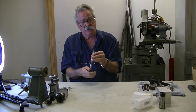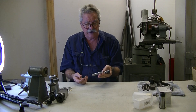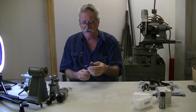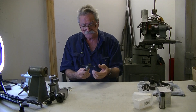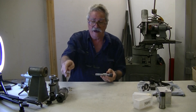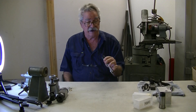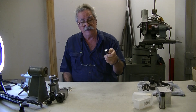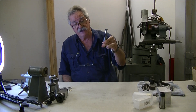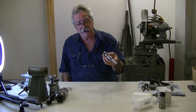This is a little beauty — once again, eBay. I think about $70 for the full set of collets up to 12mm. I'll be using that later today to four-facet grind a little drill. Plain shank, 16mm, so I can use it either in an ER-style chuck or in one of these plain bushes in the Clarkson work head. That really does give me a lot of usefulness, and it goes up inside the milling chuck if you want to do any small milling inside pockets, giving a little bit of extra reach.